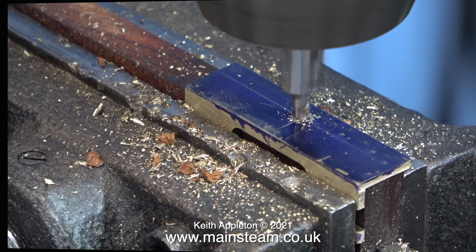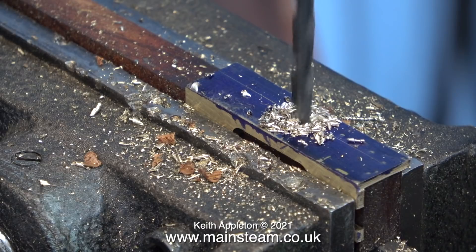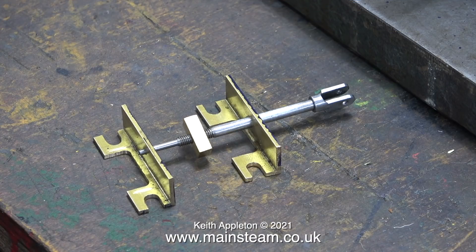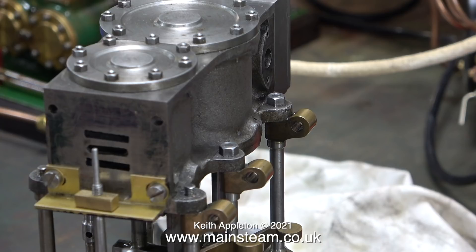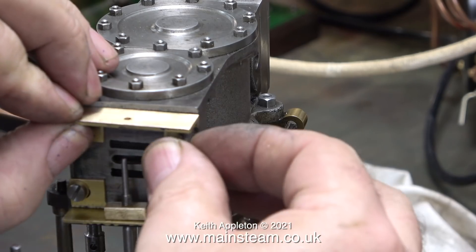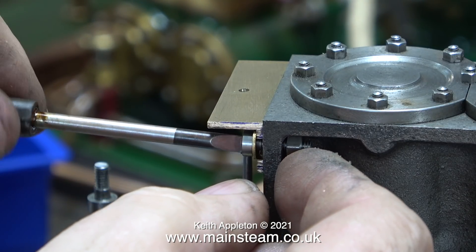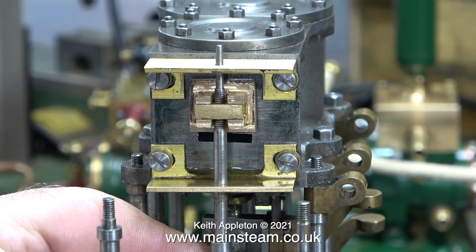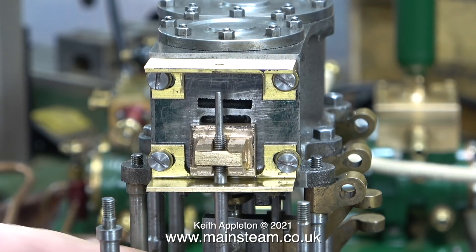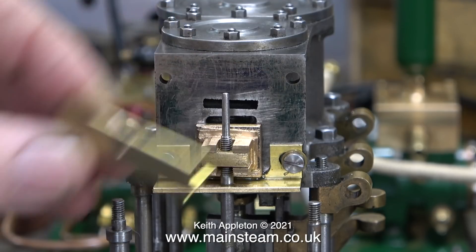I've made a mark on the brass; all I need to do is scribe a line, then place the piece of brass in the machine vise, use a center drill first, and follow it through with a five thirty-seconds of an inch twist drill. The second piece used seven thirty-seconds of an inch to match the diameter of the valve spindle. Having slots instead of holes in the ends makes it quicker and easier to fit the bolts and allows some adjustment. The valve rod must be supported at the bottom or the top is going to wobble — the easiest solution would have been to mill a block, but I didn't have brass block the right size.